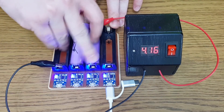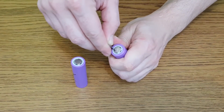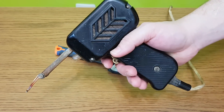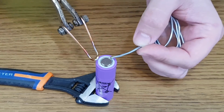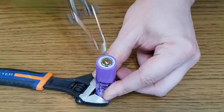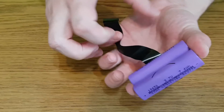Back to the electrical components — the batteries are fully charged. The correct way to connect them is to use a battery spot welder, but I don't have one, so I'll go with the popular but not recommended way and solder them. First we clean the contacts to help the soldering process. My soldering gun is a Romanian model made in Bucharest in the 80s and it's very powerful — helpful because I need to solder the wires as fast as possible. Using this powerful soldering gun just a couple of seconds at a time and giving the battery time to cool down should be fine. But if you heat up a lithium cell too much, you may permanently damage it and the cell can even catch fire, so be careful if you try this.